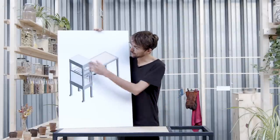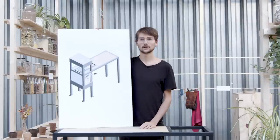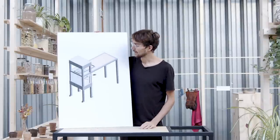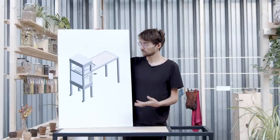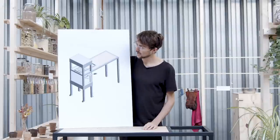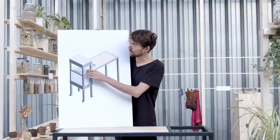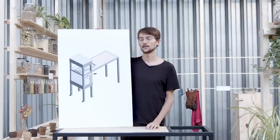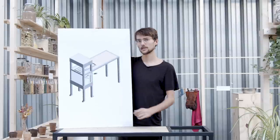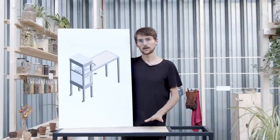So now we basically built the whole metalwork of the machine. And now we can go over to paint it. Make sure to get heat-resistant paint because you are working with hot molds and stuff on this machine. And it's really good to make these panels actually kind of glossy, so they're easier to clean, even though the matte finish looks really nice on the rest of the frame. Yeah, the sheets should be kind of shiny.